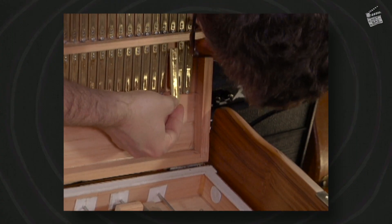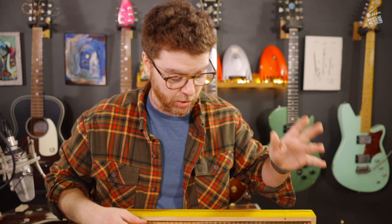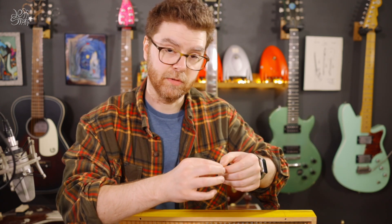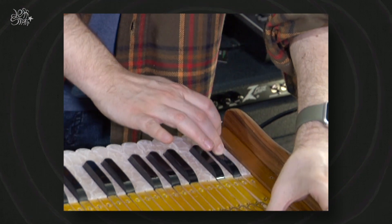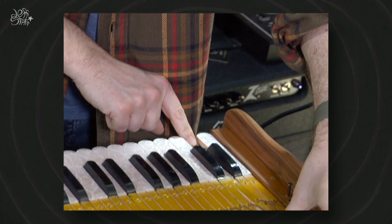Here's a quick tip I picked up from years of doing guitar setups: when you are replacing screws into wood, place the screw in and lightly turn it the opposite direction until you feel it sort of click — like it falls into the slot. Then you can begin to screw it in the correct direction to go into the wood. What you've done by going backwards is waited until it fell into a pre-existing groove cut through the wood, so the screw will continue to follow that existing groove and not strip out the wood.